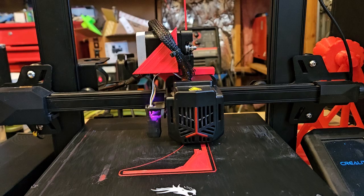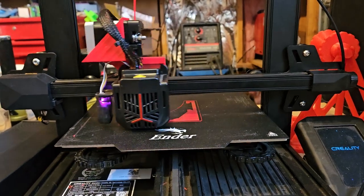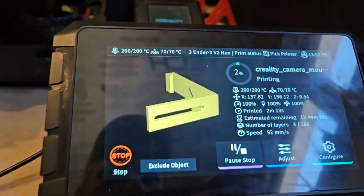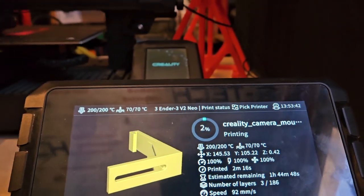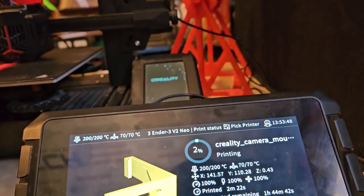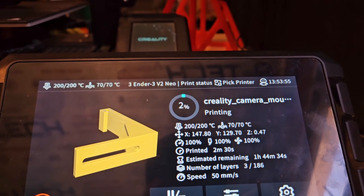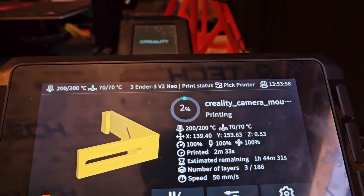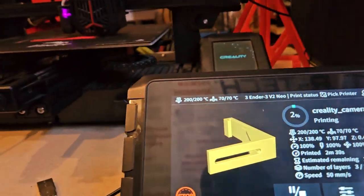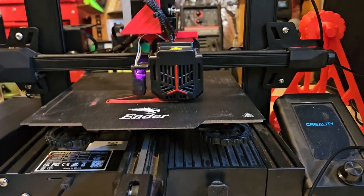But right now it's working fine, and man it is moving. Normally this thing is very very slow — I've never seen it move or extrude like this. This is more on par with what I've seen with other machines as far as speed. It doesn't show a very fast print speed, but I think the acceleration has been changed because of the calibration where it shakes the thing back and forth. Prior to doing that, this thing was really no different with or without Klipper.